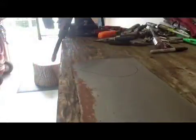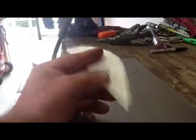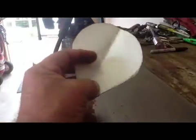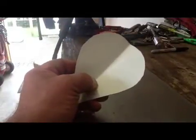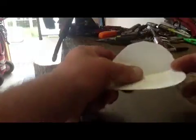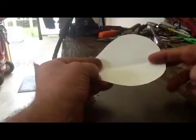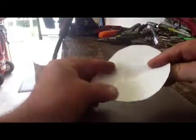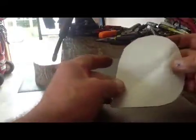So there you have the leaf marked on the steel. What I did was I took a piece of oak tag, just fold it in half, and cut it. When you cut it, you open it up and obviously it becomes a symmetrical shape on both sides — I do that a lot. Even for butterfly wings and stuff like that, I'll always fold it in half, cut it, and do it that way. So we're going to cut it out, put a coat hanger rod in here, fold it, weld it, and pinch it open — it's already beginning to get a leaf shape.